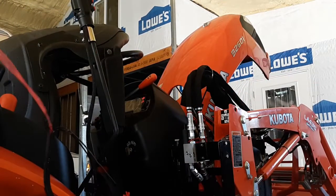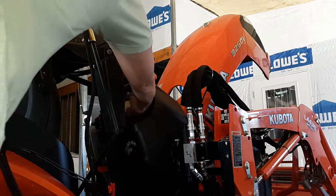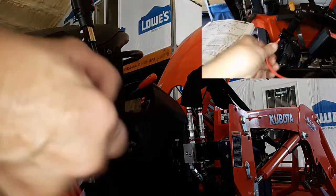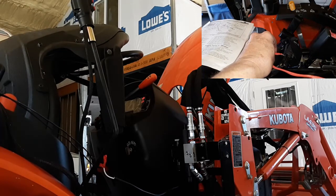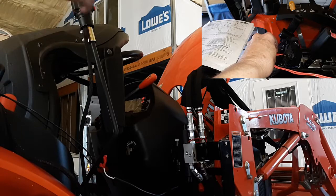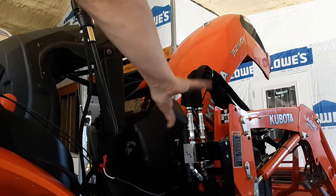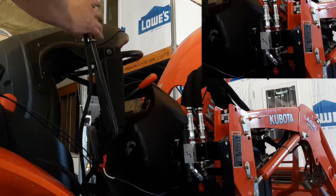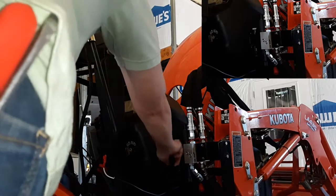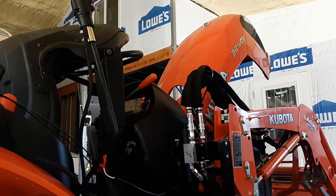So in theory, you can see the dash. Yep, see the dash. So the power's on. So I'm going to take my 2 reds, put them back on that positive on the auxiliary plug. When I hit the buttons up here, this should light up showing me that I have power. I don't have a grapple on the front or anything to move it. But can you see that light? So you could actually see the reflection on the black shroud. There are 2 little LED lights.